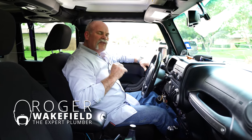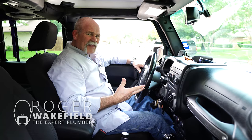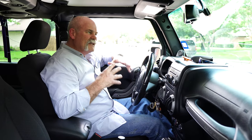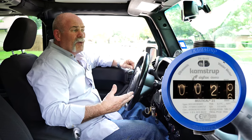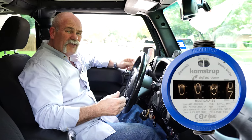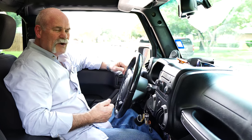We've got a unique call today. House has low water pressure and it's a new build. We don't get calls like that often in Dallas, because Dallas has grown so big that they pump up the city pressure line so high that normally we get calls from home inspectors saying there's too much pressure. So what that tells me is either we're gonna find a valve that may not be open all the way, so when they open it and try to get flow through the house they're not getting enough flow. It's really a flow problem, a volume problem, not a pressure problem.